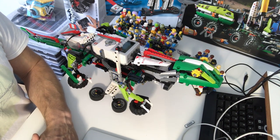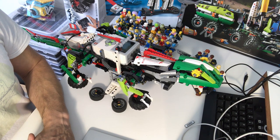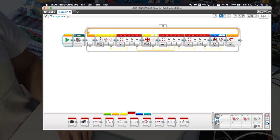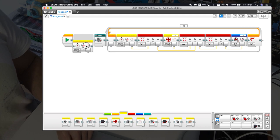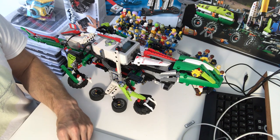Awesome — the motor position is exactly at 100 times the duration of the program. You also saw the motor started with a jolt: that's because this timer started running at the start of the program even while the body was resetting, and then it tried to match that time instantly when running this loop. So what we're going to do is also reset the timer right before we go into the loop, and we'll see that the jolt will be gone. Exactly what we needed — cool.